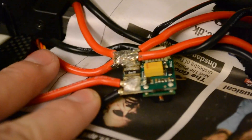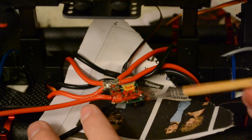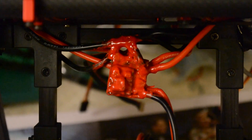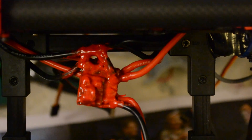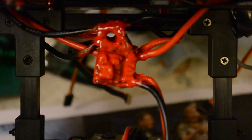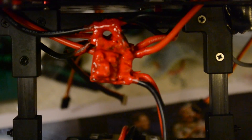Once we've got this figured out, there's quite a lot we want to cover with Plasti-Dip. We're going to cover this with Plasti-Dip — this is basically the first layer, the first coat of Plasti-Dip to electrically isolate this power module. We're going to let that dry for 10 to 20 minutes and then come back and give it a second coat, a second layer.